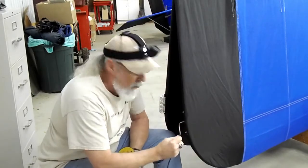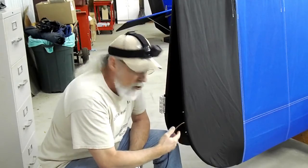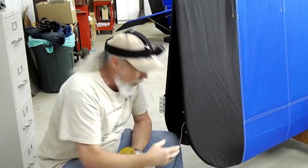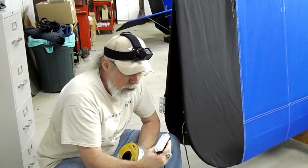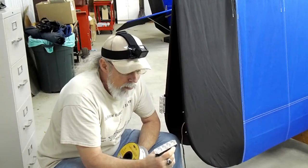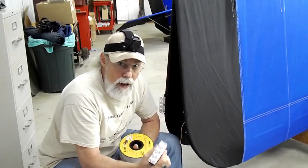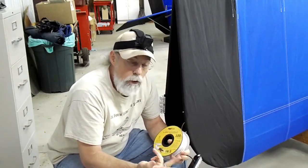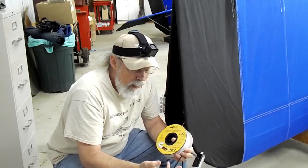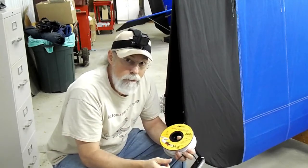This is 18-3. This is really thin speaker wire. The problem is this is probably better actually. But I've got a problem with the fact that these very, very good but very cheap Chinese strobes are made in such a way that I can adjust the patterns. I think it has like six different strobe patterns. But you have to have all three wires — there's three wires available: the hot, the ground, and then another that is like a switch ground. You tap it to the ground and it will change the pattern of the strobes.